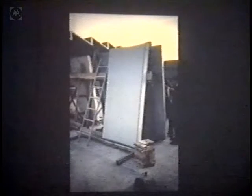So the other thing that was done, but not by yours truly, was an investigation into anti-graffiti coatings, which Sir Norman Foster and Partners, in conjunction with the Precaster, undertook to find something which didn't affect the appearance of the concrete. That's the problem with most of these things. Most of the treatments make it look as though the concrete has been coated with varnish, which looks pretty ghastly, I can assure you. They did find something that was reasonably successful, so that if there is ever any vandalism in the form of spray paint or magic markers and things, it can be cleaned off relatively easily and certainly without affecting the concrete.